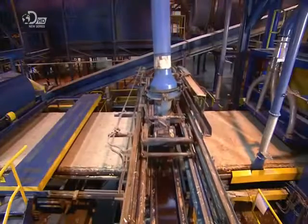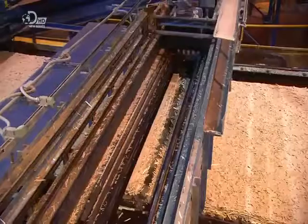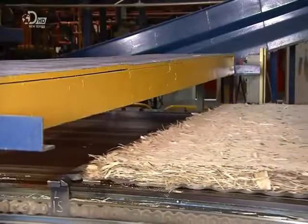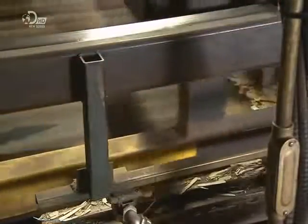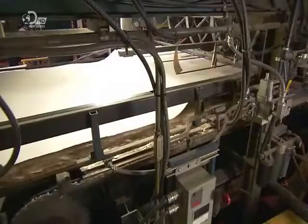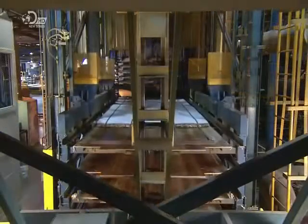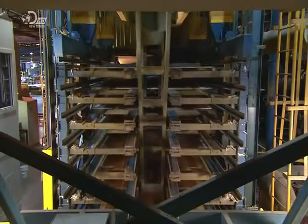A carriage now moves a large circular saw back and forth to cut the mat into sections, approximately 5 meters in length. A steel carriage stretches a sheet of heavy industrial-grade paper across the mat strands. The paper's been coated with a primer and saturated with a durable adhesive that bonds with the wood strands. A multi-tiered press closes to both compact the mats and bake them.